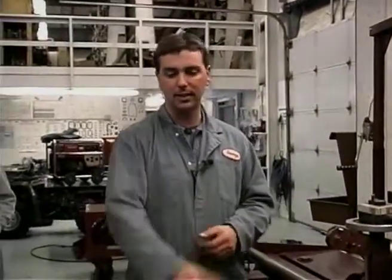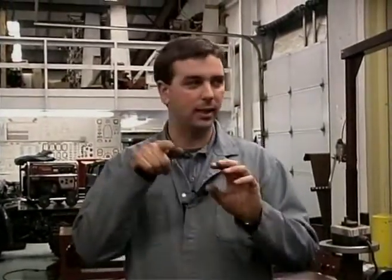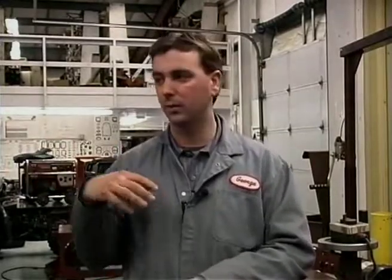I can still use that tape. We use that tape on here. What we do is we check to see if we're cone shaped. And if we're not, then we use the dial indicator, get what we think is perfect. And if we're perfect, it should just touch the reel all the way down from one end to the other. And so we use it to speed up the process of how we adjust that one.